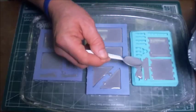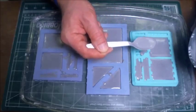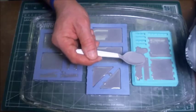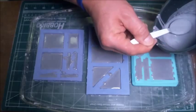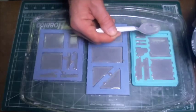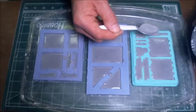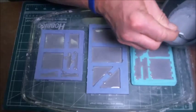And all you do is make up a mixture of that. You pour that into the molds before the first cast. Push it in real good with a brush, and then give the mold a little rinse with clear water, and you're ready to pour. What that does is it helps to minimize the little air bubbles that you might get in the mold.